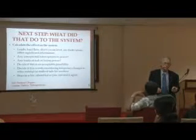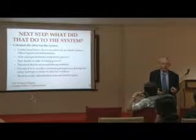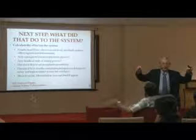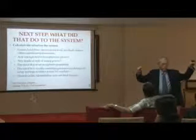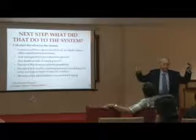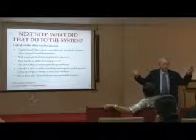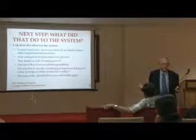What they want to do, and they claim it's very important for their operation, particularly in the wintertime when it's cold, if they have power coming on this bus and power coming on that bus, they want to close the breaker, parallel the two buses, and then open one. And then they transfer the load without any loss of power, and everything keeps running. That's a valid operating condition.